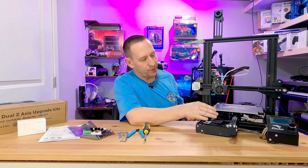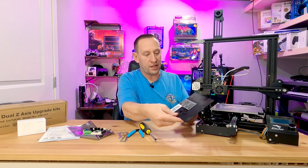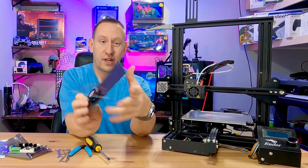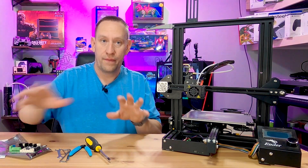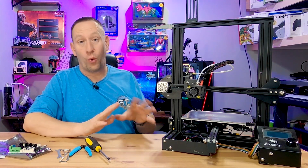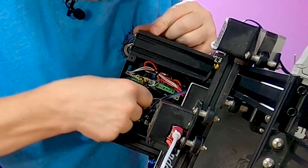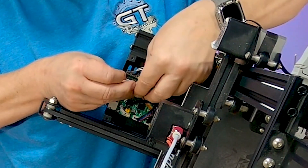The install is going to be quite simple. There are three screws on the top that you take off to get the cover plate off. The fan will be attached — I'm going to unplug it just to get it out of the way, but you don't have to. Now you're going to have a mess of wires here. I would recommend unplugging everything first.